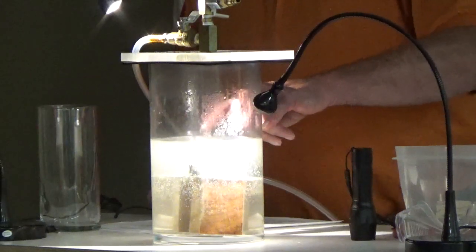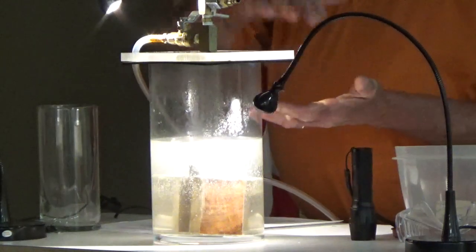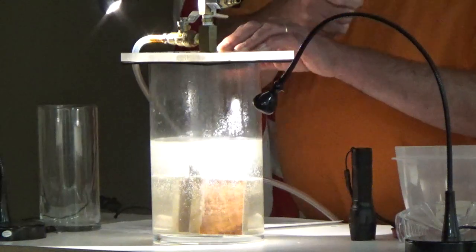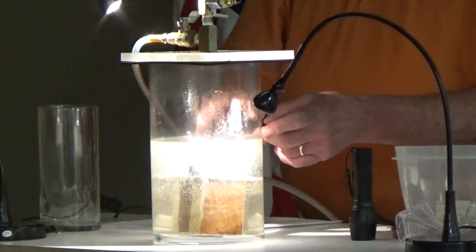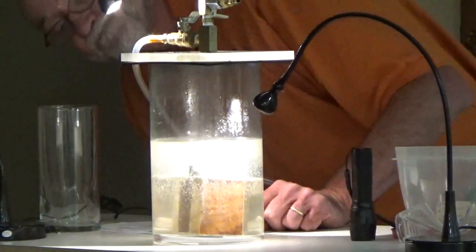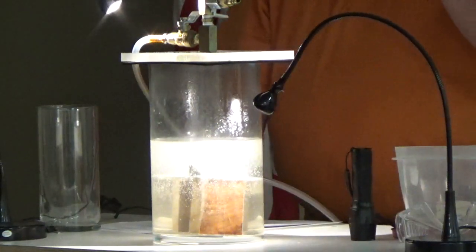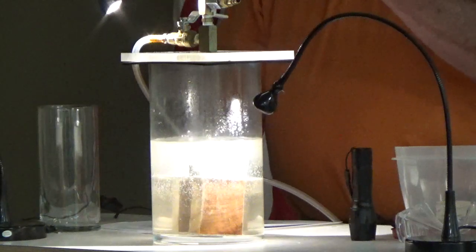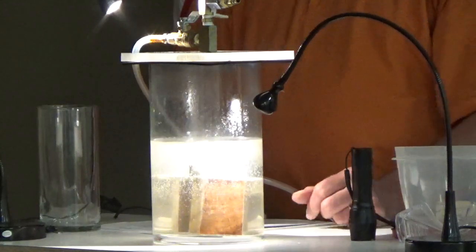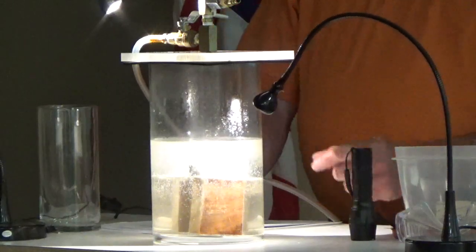After about an hour or two, maybe 3, with the resin, those large bubbles you saw will settle down to where there's nothing. In about 30 minutes, you'll get to the point where you can leave this all the way open. But after that takes a couple hours, and then you'll get rid of most of the bubbles. Right now, these are close to champagne-style bubbles, like carbonation in a champagne glass, bottle, can of beer, a glass of beer. Okay? That is the moisture being sucked out of the wood. In several hours, you'll be down to just those bubbles, if there's any moisture left.